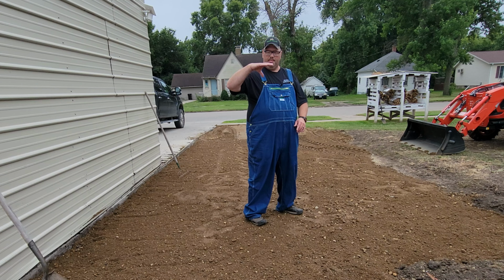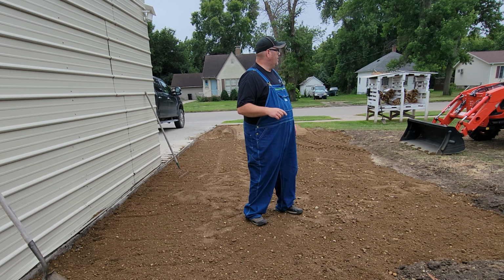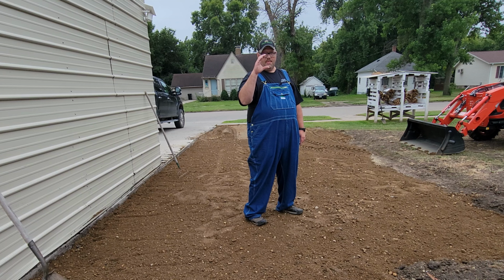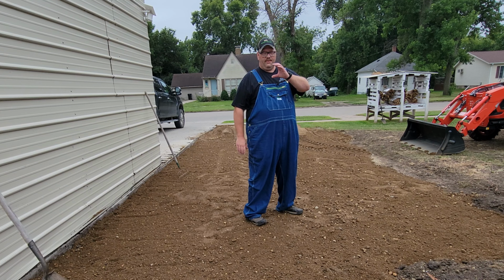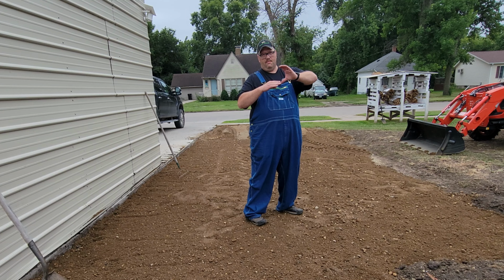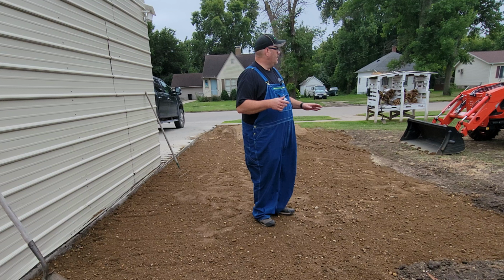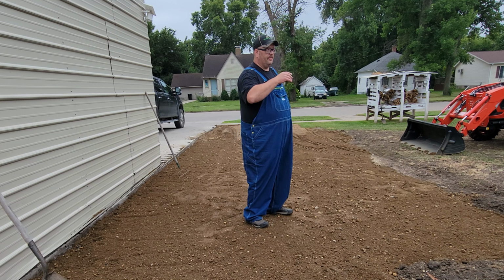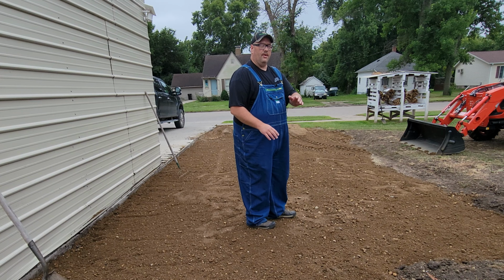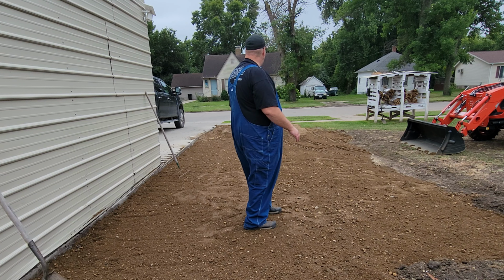And then this blade on the bottom, that C-shaped blade, is also gonna grab and roll the material up. I didn't want to do that here. I wanted to spread it, so that's why it was back like this. So then the back edge of that C, so basically this is the back side, now this is the front. It's just back dragging, similar to putting the bucket down at an angle and then back dragging. So it's really good for just dragging it out. It's all I needed to do with this sand and gravel. Didn't really want to dig it, just wanted to move it, and it works really good for that.